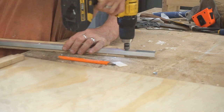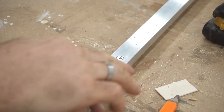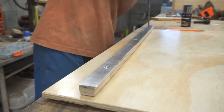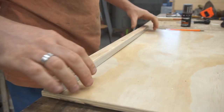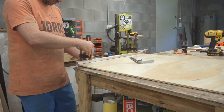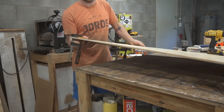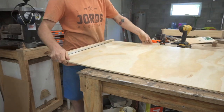The nice thing about working with aluminium is it's soft enough for you to use most of your woodworking tools, so using a regular drill and countersink bit I've been able to sink that screw. I've come in from the back of the plywood and where the screw punched through I put in a business card, which was just thick enough to keep the strip off the plywood so that the paper could feed through it.